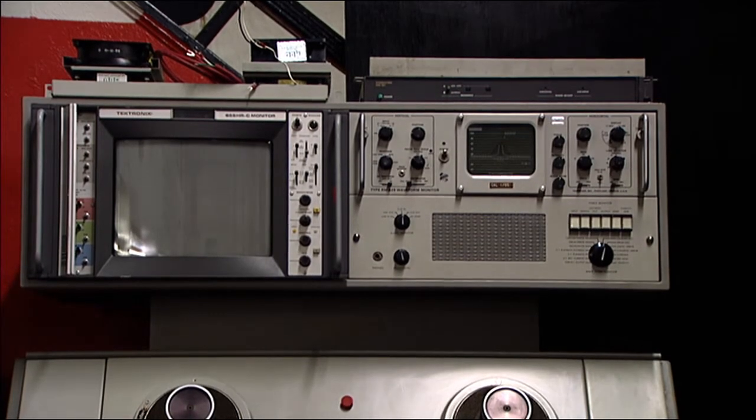The monitor bridge here on top of the VTR will be upgraded. It will have the monitor you see — a Tektronix Trinitron high-resolution monitor — that will stay, but it will be properly rack mounted. The control panel on the bottom right will be cleaned and adjusted, the audio amplifier restored. There's an audio amp and a monitor speaker behind the little grill. All the switches will be cleaned and the power wiring will be replaced.